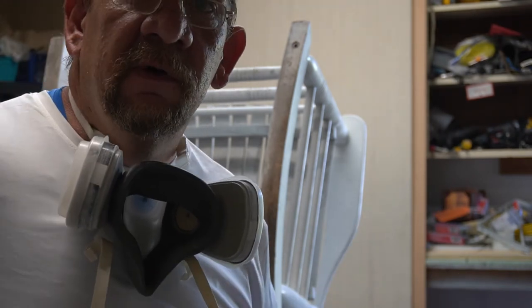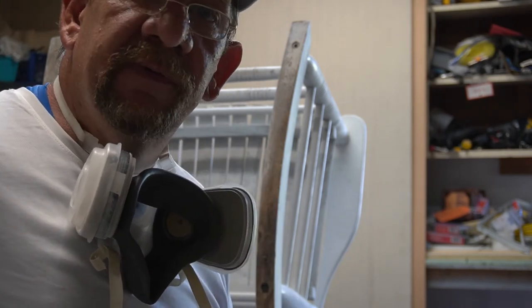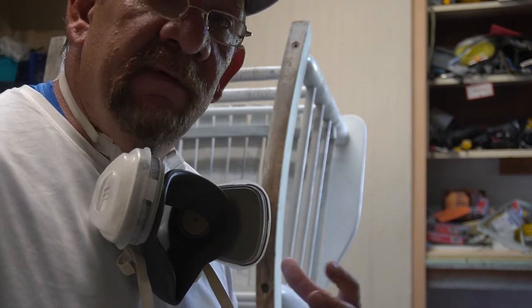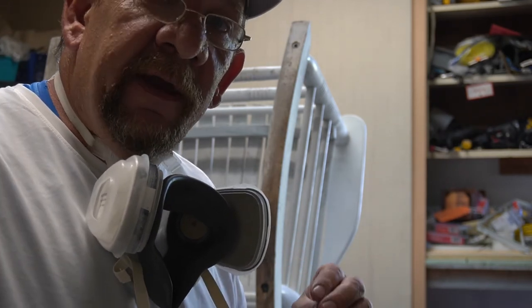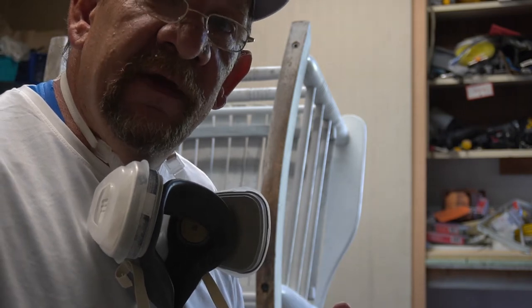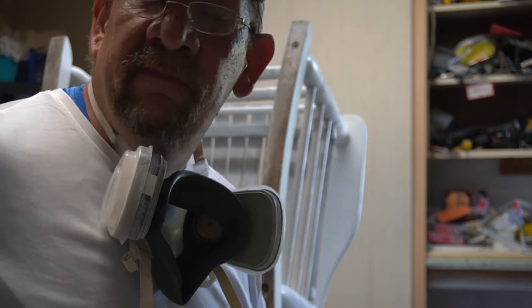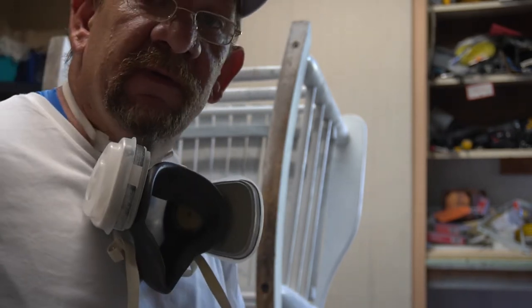I got a bigger airless Graco, the Pro 17. I like it, but even with the Breakthrough not being thinned at all, just straight from the can, it still runs with it. And I've adjusted the settings, I don't know how many times, but that thing's 3000 PSI max setting. This thing's 1000, so I'm hoping that's gonna work.